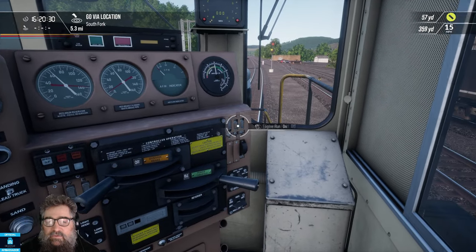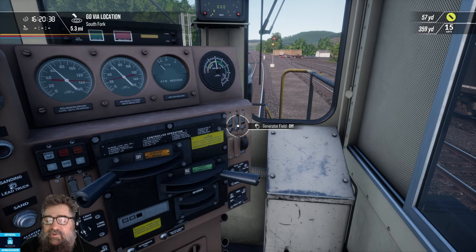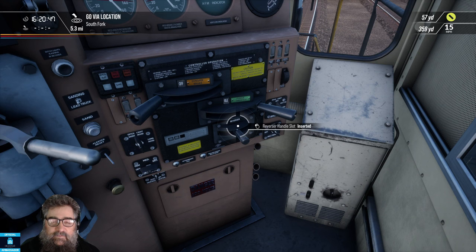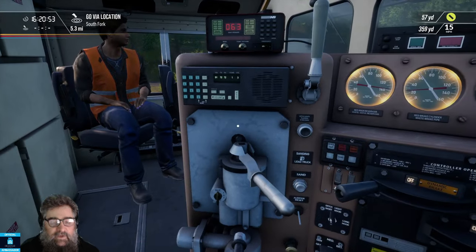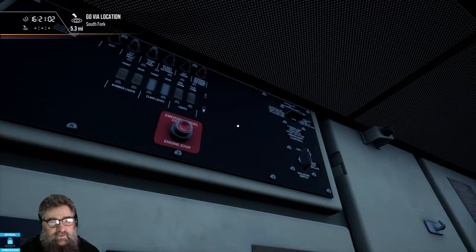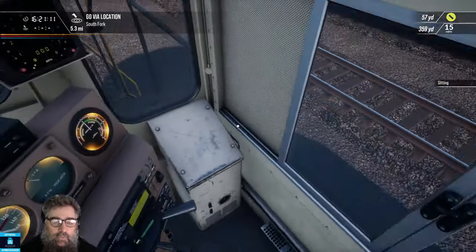Let's get moving. These two switches were surely already on, or that engine you can hear idling behind me wouldn't be. Let's set our headlights on — I've just put them on dim. That just lets other crews know that this train is active. I'll put our reverser in. Let's continue with the lights: some gauge lights and our step lights. I want to set this to be a controlling unit with the unit coupled at the long hood end — that just sets the headlights up. Platform lights on, engine room lights — we don't really need them but let's turn them on anyway. Number lights — that helps people know who we are.